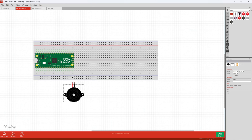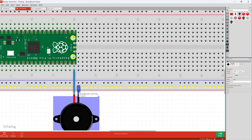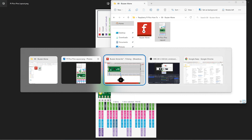I'm going to connect mine to pin 20, which is GPIO 15 of the Raspberry Pi Pico — it's just an easy pin for me to link up. I'll zoom in, move things up a bit, then click and drag all the way down until the red wire connects to my pin. I'll do the same thing for the ground. The ground pin I'll use is pin 3 — I remember pin 3 is ground. I'll go back to my diagram just to confirm everything.